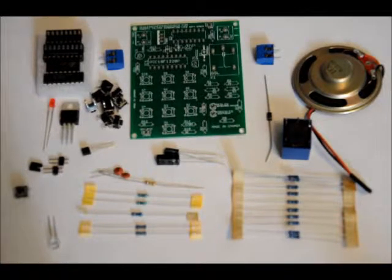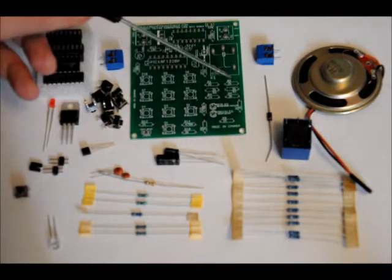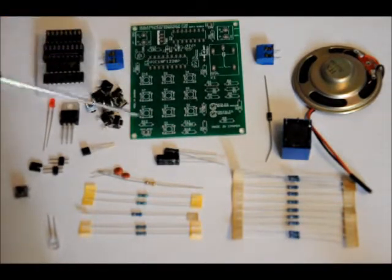We're going to assemble this piece by piece. I always like to start with the resistors because they're the least invasive on the board and very easy to do because there's no polarity. The 160k resistor is placed here — it's labeled OSC for oscillator. It's labeled 168k on the board but the kit includes a 160k resistor. R13 is labeled R13 10k. R11 is labeled R11 100k, so place your single 100k ohm resistor there. R16 is labeled 10k, so place your other 10k ohm resistor there.